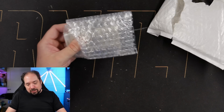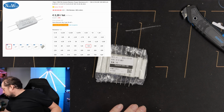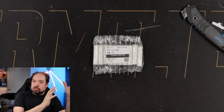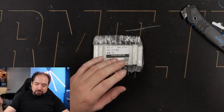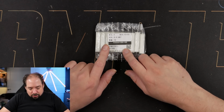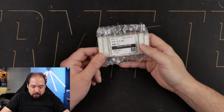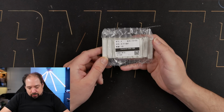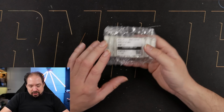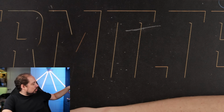Oh, right. Okay, so I bought this slightly too quickly. When you're building a setup that has batteries and inverters and chargers and things like that, sometimes if you hook up a giant power source to a giant power sink, it'll suck up a lot of power instantly, and that could be bad, like 1,000 amps of current. So I got some resistors, but in the end I changed my mind. Now I'll probably use these for something at some point. These are 10 watt 15R. That's not actually correctly sized because I have to use a higher resistance if I wanted to limit it to 10 watt, but in the end we'll see what other resistors I have too. So don't buy those if you're trying to follow along.